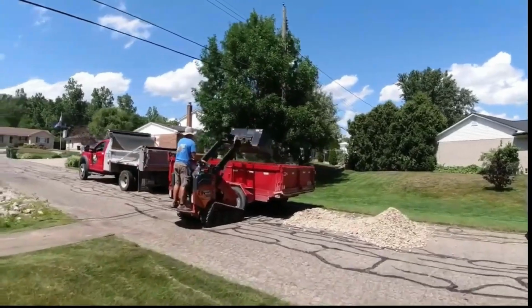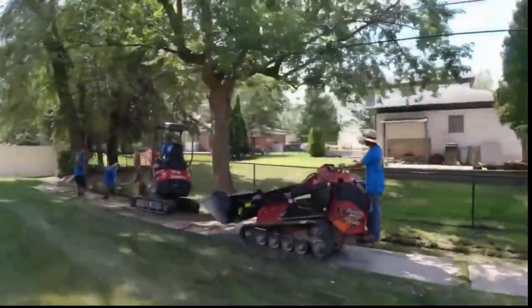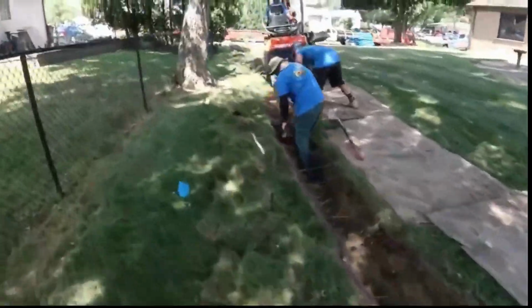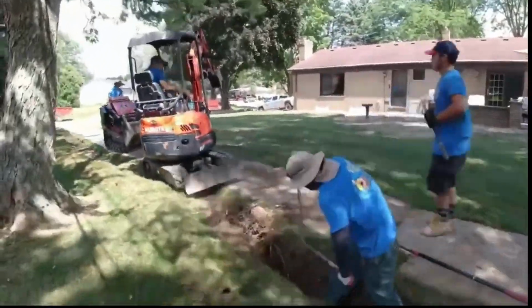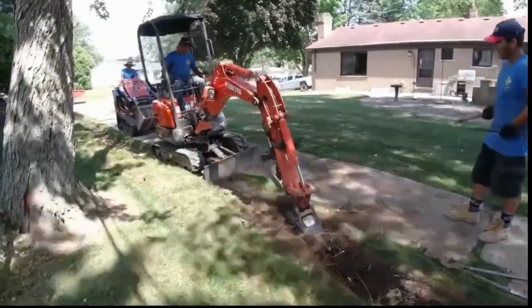First question that comes to mind is, what's the difference? A yard drain is when you use solid pipe and you use inlet basins to take in bulk water during flood events. And then the French drain is when you do the fully contained burrito wrap with no inlet basins, so that way you don't get any debris in your French drain system.